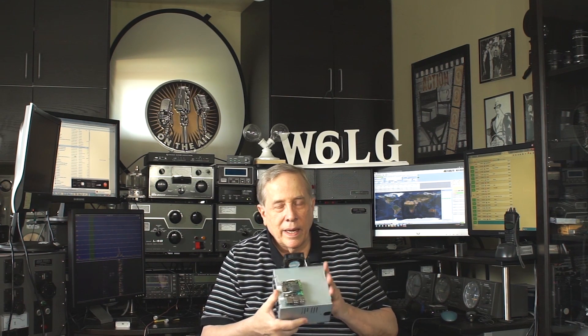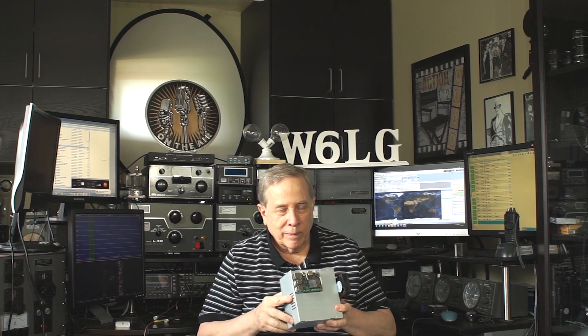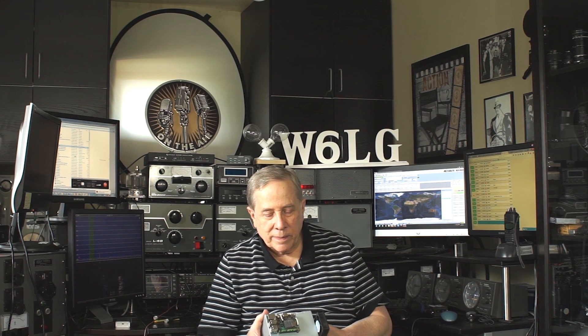It's had a number of issues. I've got it mounted because this is what my last-ditch effort is. I'm kind of getting ahead of myself, but we'll get to this in a minute. This is the Tinkerboard, and I've mounted it on a power supply. I'm suspecting, despite the four power supplies and all of them rated at more current than the thing is drawing, that perhaps it was hearing noise. Maybe there's some issue with the USB port that's on it.